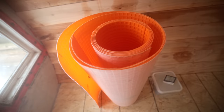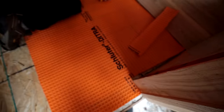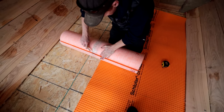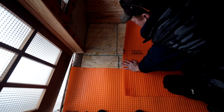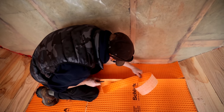We've got some interesting stuff going on the floor — the Schluter company makes this, it's a Ditra membrane. It's a decoupling membrane and also a waterproofing membrane. Saunas get a little wet and we want to protect the subfloor underneath the tile, because tile and grout is not necessarily waterproof — the tile itself is, but grout is not. So if you're ever doing a floor in a wet room like a shower or bathroom, this Schluter stuff is great. It also acts as a decoupling membrane, and your tiles actually feel warmer — even on a concrete basement floor, putting the Ditra down keeps your tile warmer than direct concrete. In this situation, it'll also provide warmth from the floor below.